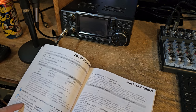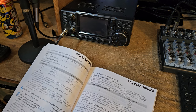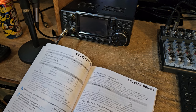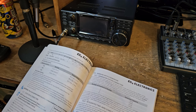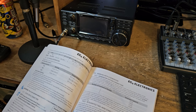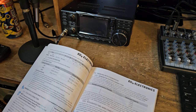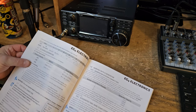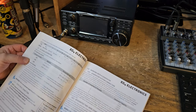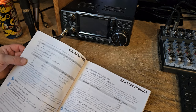Okay, always be sure to connect the AC output ground wire to the terminal bus. Please follow the steps below. Before installation of any wiring, please ensure all breakers are off. Well, that's common sense. Strip the insulation, fasten the AC input wires to their respective terminals using fine stranded wire. I'm wondering what the current requirement is. What do I have? I've got 20 amps, 240 out here.